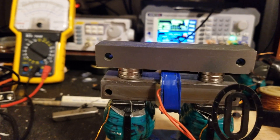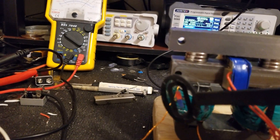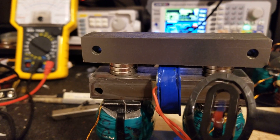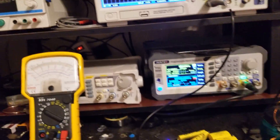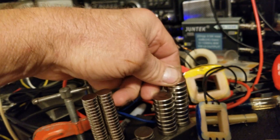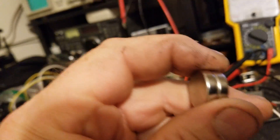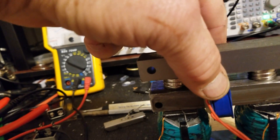You come down here and it starts to get really strong. These magnets are almost three-quarters of an inch in diameter and almost an eighth inch thick, which I think is five millimeters. I've tried two of these on each side and it seems like two of these, in comparison to three of those, is too much — too much flux, at least for this coil to be able to switch it.